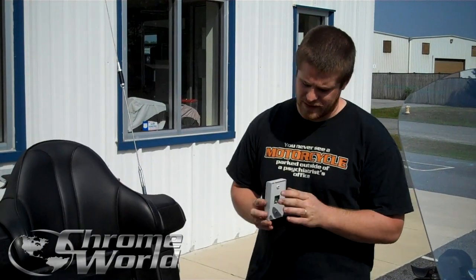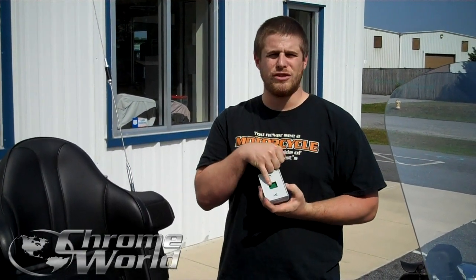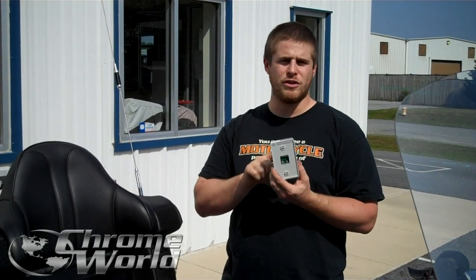We'll go over the easy part first. You just pop this face off — you've got your two screws in the back for your garage door opener, just screw them on and you're done. If you've got a fancy garage door opener with a lock and a light and all that, and you don't want to get rid of that, get a piece of wire, cut it about yay big, and just jump it off of that control you have to this one, and you can still use both.